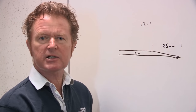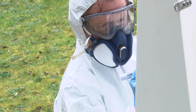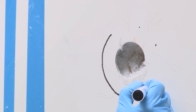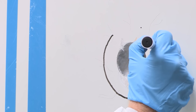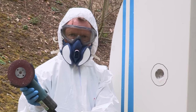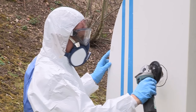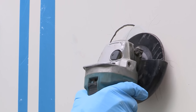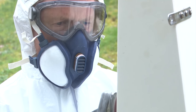We need to grind this with an angle grinder. I already measured the thickness of the laminate at 2mm, so my bevel needs to be approximately 25mm. I'm using a disc grinder with a flexible sanding disc with 60 grit to create my 12 to 1 bevel.